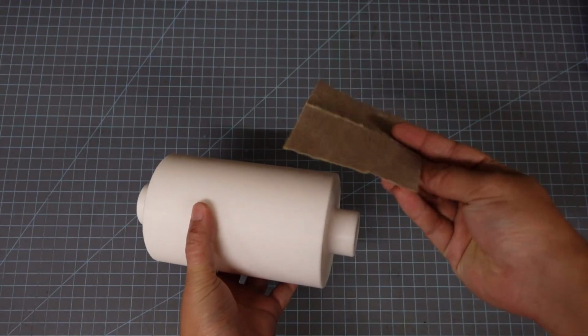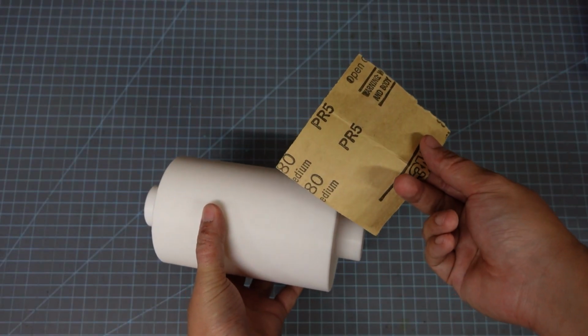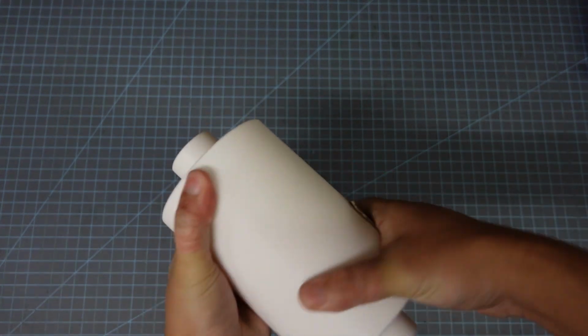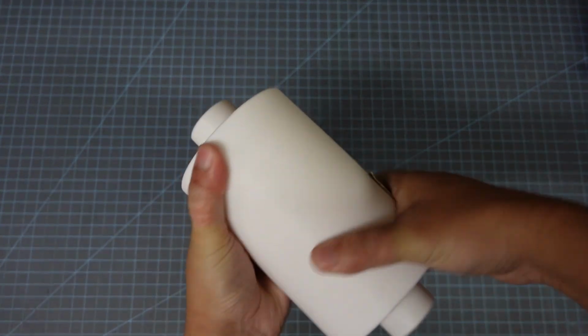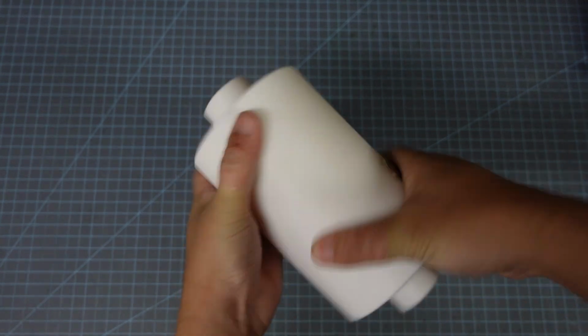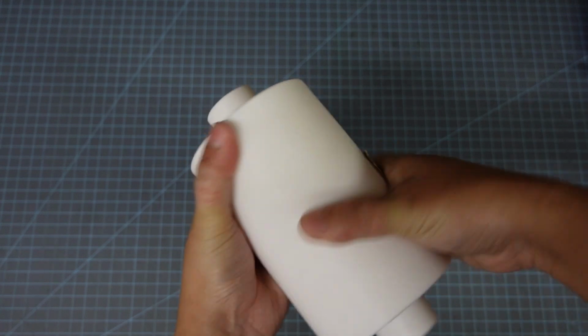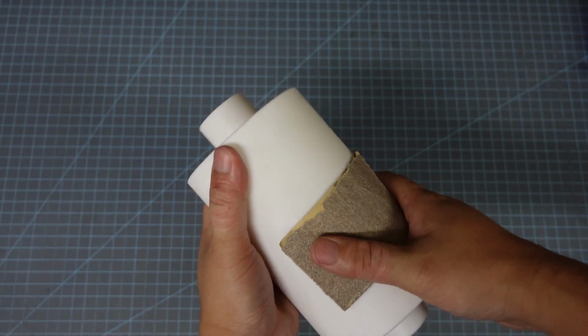Next up, we need to sand the top and bottom rollers. We printed the rollers with a random Z-seam, so it maintains a relatively uniform thickness all the way around. If you didn't, then you get a little bit of one high spot on your roller, which might interfere with pressure.